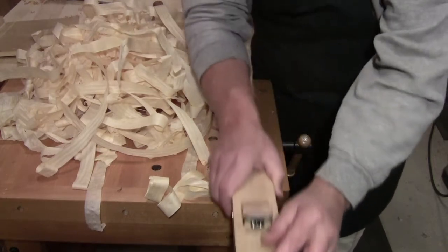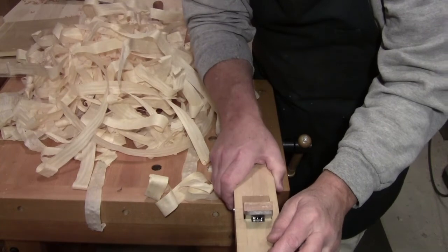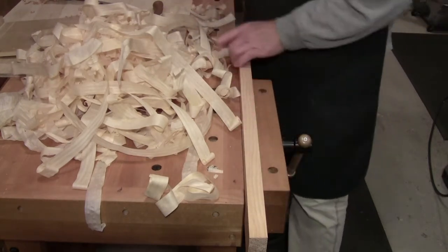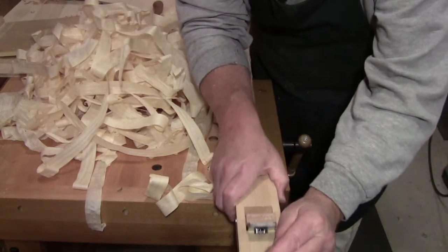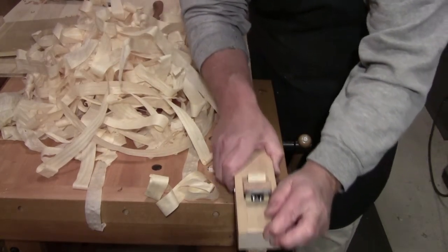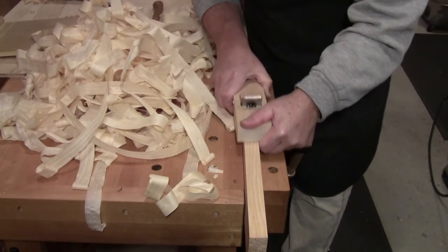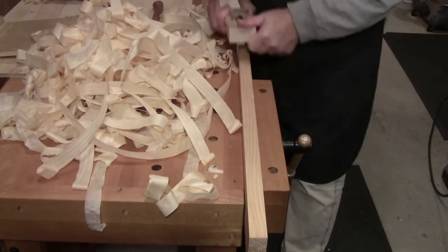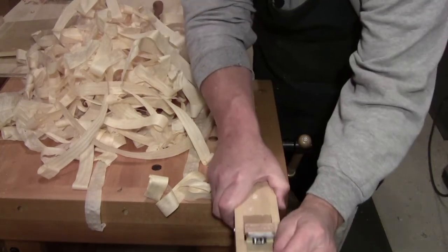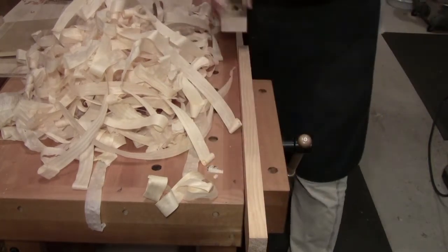Right now I'm taking a fairly heavy cut, and I think some of that sole tuning will aid so that I can get the cut down. But this is pine — if you recall, or if you want to go back to my original layout, this blade is in at 52.5 degrees, so it's meant for smoothing and it's really meant for hardwoods. But she's working pretty good.